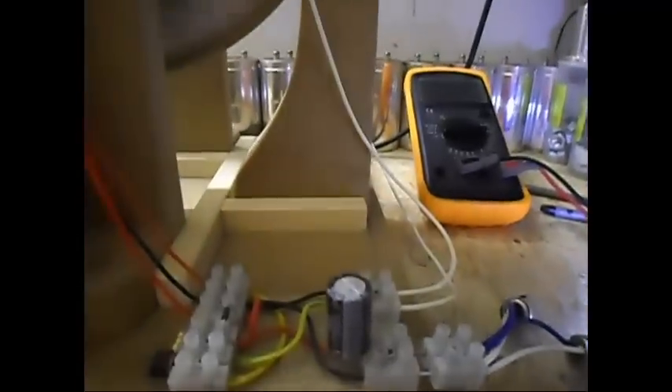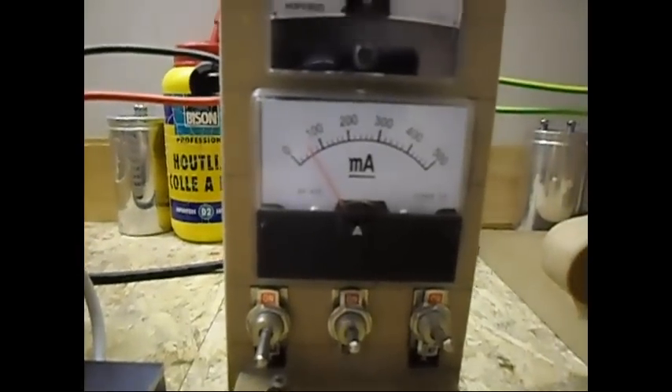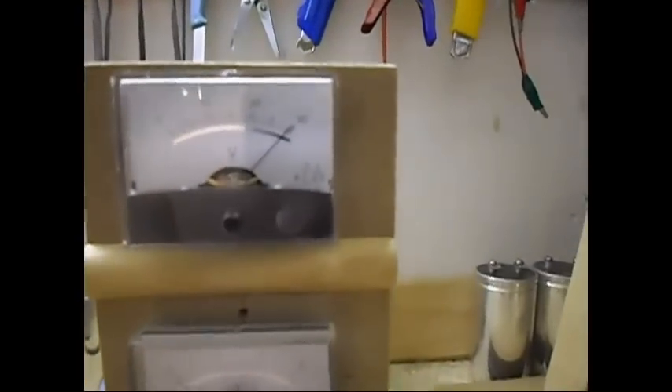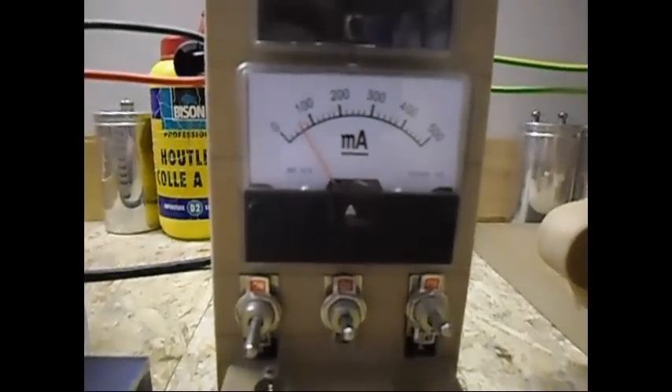At this moment, this side is also still pulsing, still driving the rotor, and also filling the capacitor. That's why you have the energy. And this side will stay around 29 and a half volt DC at, let's say, 60 milliamps — doesn't go any higher.